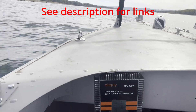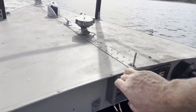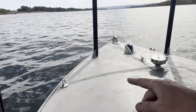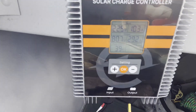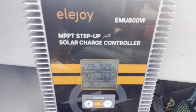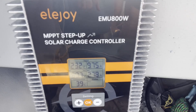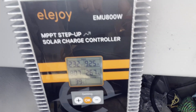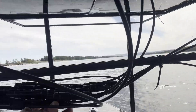Then we've got the solar panel step-up charger. This was the old one — it was a 400-watt — but it just wasn't able to handle all these panels, so we got the 800-watt solar controller. You can see all the data there: it shows you voltage and amperage in, and then you can set your voltage out, and it'll correct whatever amperage it needs to to hit that voltage. As you can see, we've got just a cluster of cables here — super safe!